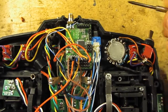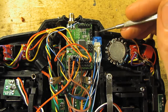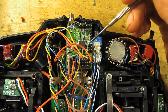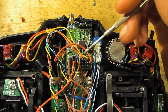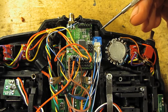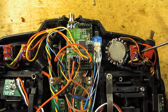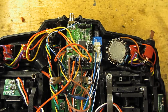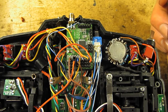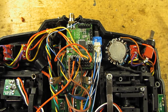For those interested in pursuing this yourself — you do need a little bit of electronics knowledge, and all the information's available on the web if you Google a bit. You need to modify the source code to output the LEDs on the other pins instead of the onboard LEDs. I'll put a link in the description to my little fork of the OpenLRSNG firmware — I maintain that just for myself so I can reflash and keep it in sync with the main branch. If you want to go that way, great, but I strongly suggest just get a module, plug it in the back, and if you want the antenna coming out the front, reroute some coax and put an antenna mount on the top. Much, much easier. Cheers, thanks for watching — I expect a few more OpenLRS videos coming soon.